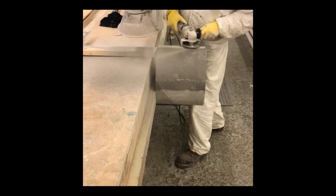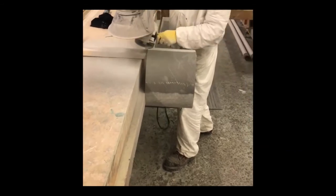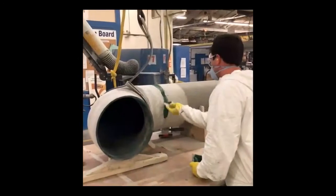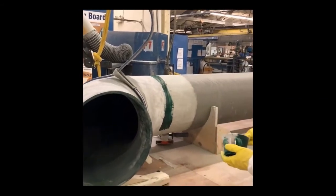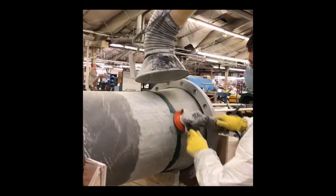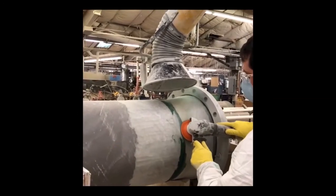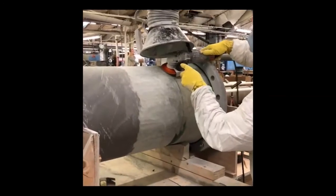In the shop demo, the technician grinds off the wax top coat — he has to make sure he gets all of it off because it has wax in it and you won't get a good bond to it. He then liberally applies the crevice paste to the crevice after fitting the pieces of pipe together, filling in all the little nooks and crannies. Then he grinds off the majority of that once it's cured, leaving only a thin line of crevice paste for a good bond.